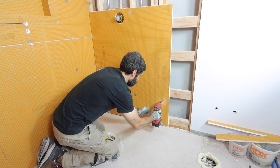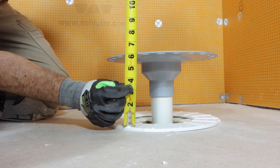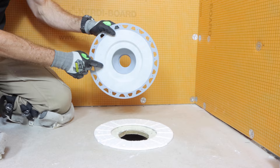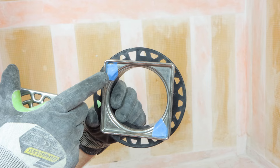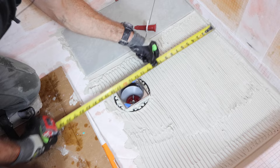KERDI board is a super solid waterproofing backer board. The next step was to add the drain. I added my foam gasket and chamfered the top of the pipe to get a tight fit with the KERDI drain. I then measured between the bottom of the flange and the top of that gasket, and used an internal pipe cutter to cut the pipe to size — then chamfered the newly cut pipe for a tight fit. For waterproofing the KERDI drain, apply thinset using the KERDI trowel, embed your KERDI donut, and smooth it out using a 6-inch drywall knife. Make sure there's no thinset in the recess. The Schluter drain grates are adjustable — they go up and down and side to side. Apply thinset between the drain grate and the black plastic, and make sure it's square so your tile will set properly.